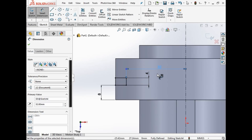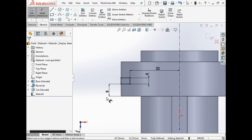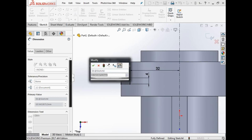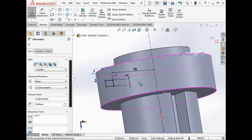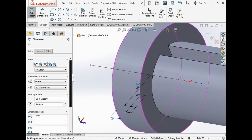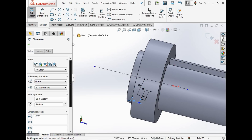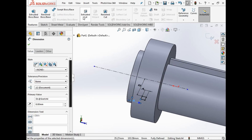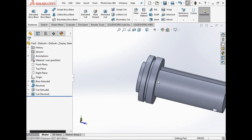The depth of the groove from the center — we'll call it 32. You could also dimension it the other way, from the crown, and put 8 there instead. If you change one dimension it will follow. In a sense we're cutting outwards — we're actually machining in a way.